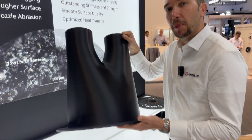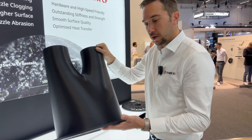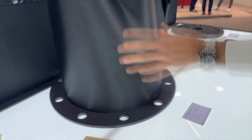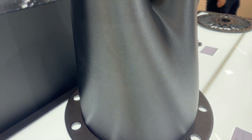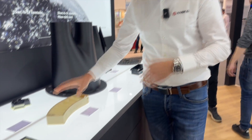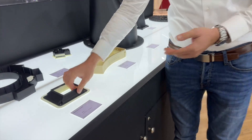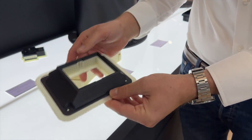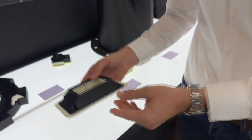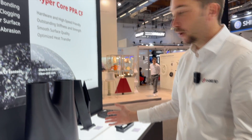You can print amazing parts in PET filled with carbon fiber — the surface quality is outstanding. You can also go for really high performance materials like PPA filled with glass fiber. Of course, thanks to the IDEX system with two print heads, you can use support material and build material from different filament types. That covers the sample parts of the RMF500.